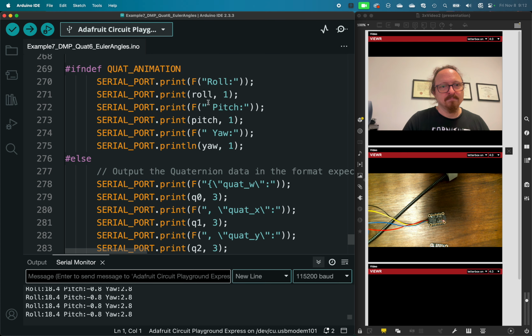This sensor is much improved now that InvenSense has made that DMP processing available, and SparkFun has put it into their library. Before that, these sensors were actually very hard to use, and I would recommend something else. But like I said, now that we have that processing available, these are okay.